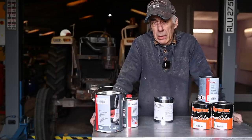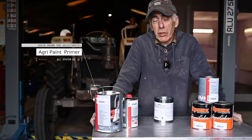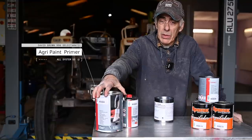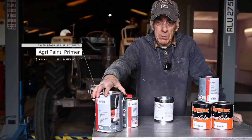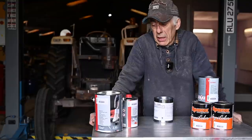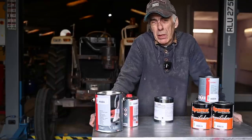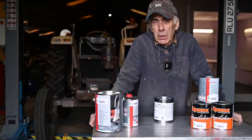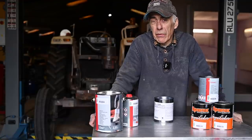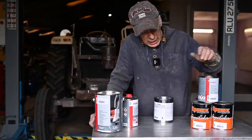I'm not going to paint it like I normally paint a car, because this is not a car and it's not a showroom tractor - it is a working tractor. Therefore I'm going to use different paint - paint which is a bit cheaper. To begin with, I'm going to give it a primer, and this is an anti-rust primer. It takes about 12 hours to really dry, so it is not like normal paint. If I were doing a car I would use epoxy paint on bare metal. But in this case I use this different type of primer - really good against rust. We call this often agriculture paint. I have some solvent with it because I want to make it liquid enough to spray, probably at 1.5 to 2 bar with a 1.5 opening on my spray gun.